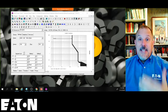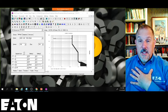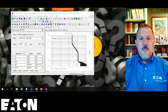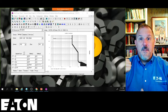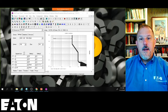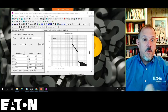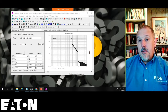Now, on a life safety system, what I was doing outside of the nuclear experience that I have, for the industrial power systems and the commercial power systems, especially in commercial, they didn't care. An Article 700 system doesn't have to have a generator. I can have a completely reliable system. I just have to get them out of that building within a certain time period. So I would coordinate to an arcing fault current, which I used a percentage because I didn't have 1584, and it worked for me then, and it could work for one of you guys and gals out there with regard to your application.